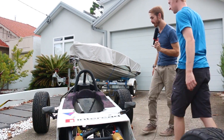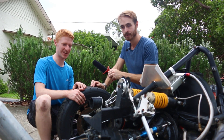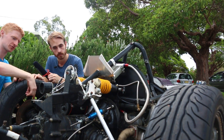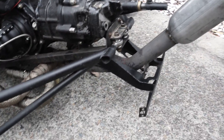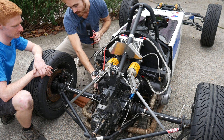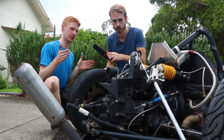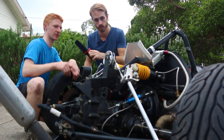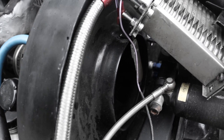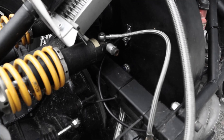Let's move along to the back, because we're running quite a different setup at the back compared to what I'm normally used to. This is where things get really weird — this setup is pretty much unique to Formula V. We run this setup because of the constraints of the old Type 1 Volkswagen suspension. Basically what it is: axle tubes that run from the center of the gearbox out to the wheel, and they're totally constrained to the wheel itself. So as the wheel moves up, the camber just follows the bump — they pivot around this section here. We've also got leading arms which go to the rear of the gearbox and just control the toe. Push rods transfer the force up to the springs through a bell crank. At the front there's a rocker, and as we go through, say, a right-hand corner, the right-hand wheel will try and move up, the left-hand wheel will try and move down, the front will pivot — effectively providing no rear roll stiffness. There will just be stiffness through the springs for bump.